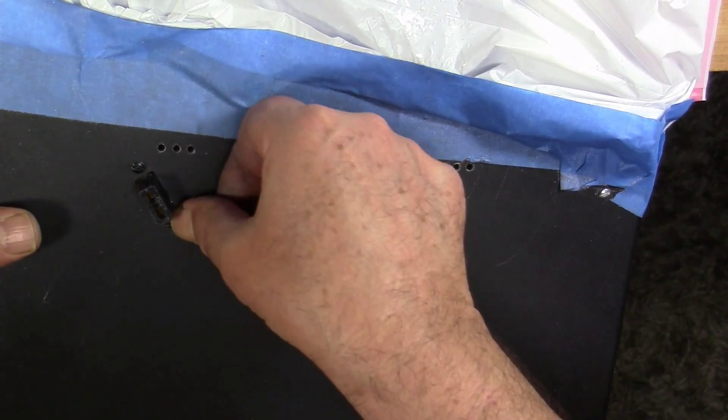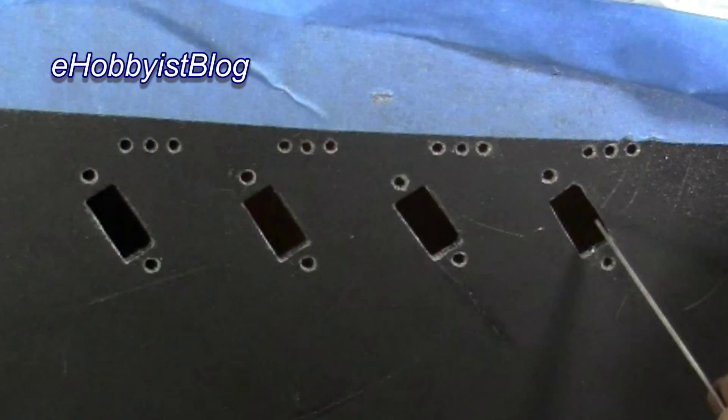The next order of business is to drill out the slots. This is the largest bit I can accommodate on this particular drill — a quarter inch. The idea is to remove as much metal as I possibly can, because I'm going to shape these rectangles with files. We apply some cutting oil and start removing material from the power transistor slots. This is not terribly accurate and I'm going to have to clean it up. I can't use the drill as a milling tool, so I'm going to use a rotary tool as a milling tool.